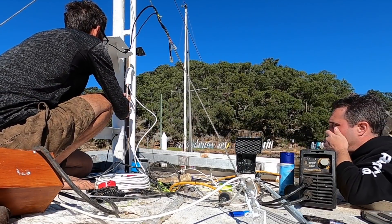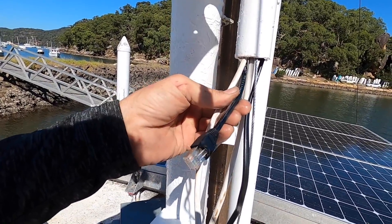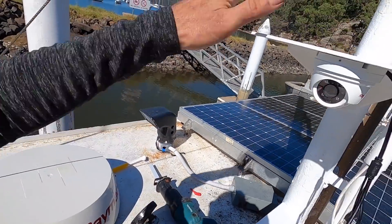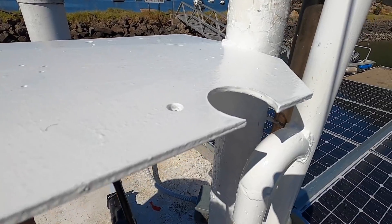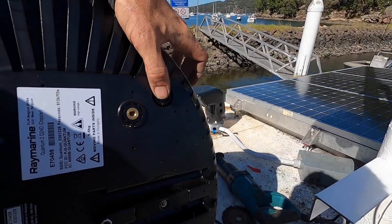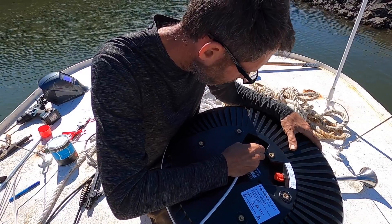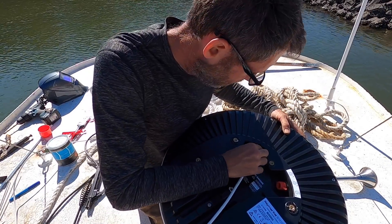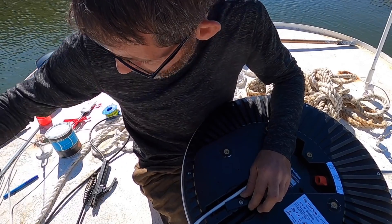Gently — we're going through the bend now. This is the tricky bit. After a bit of a struggle, we finally have Ethernet for the camera, power for the camera, power for the radar, and the Raynet for the radar. I'm going to connect the radar cables to the underside of the radar and then get that bolted on. A really important point — this is a Gore-Tex drain point for any moisture that may gather in the unit, and there's a big hole in the mounting plate so that water doesn't get trapped. Data cable — a couple of guides so we know which way around it goes. And the power cable.